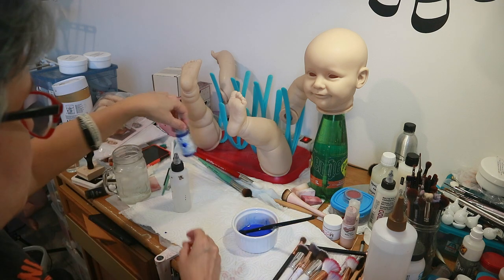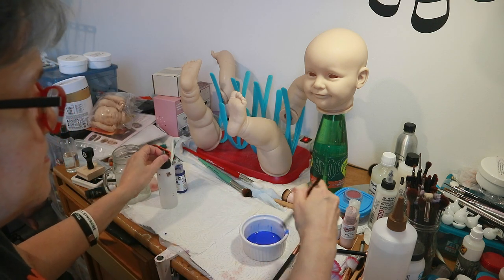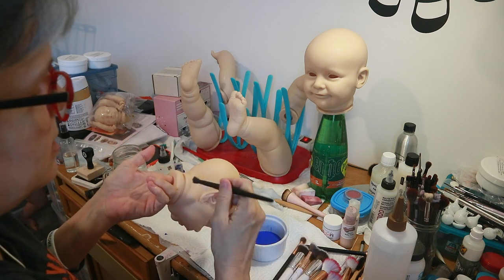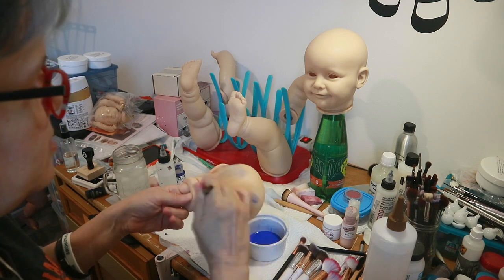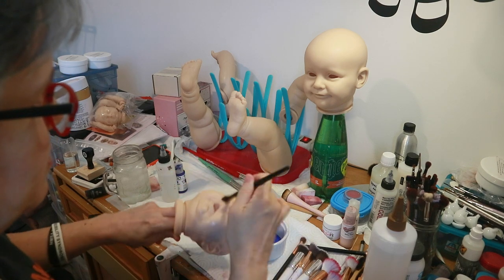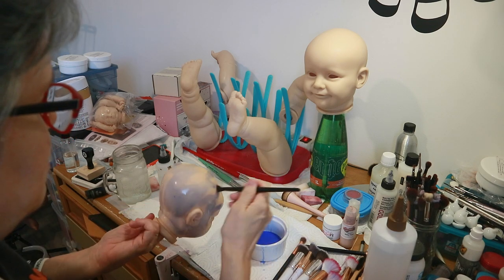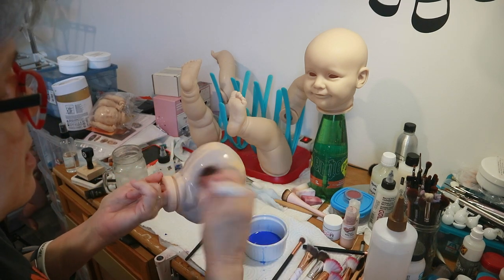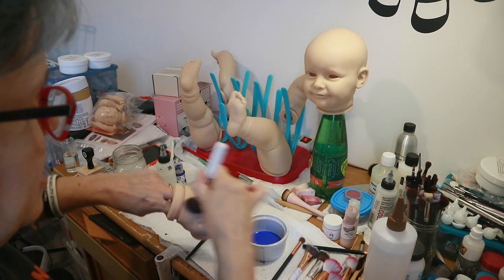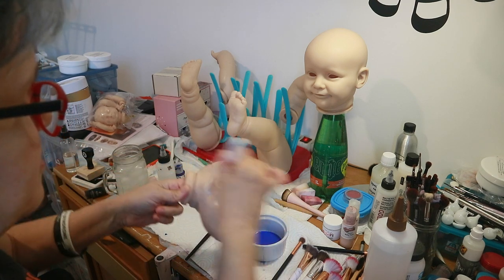All right, let's paint this baby. When I do washes I just paint it on and wipe it off — pounce it off, wipe it off. I make kind of streaks and then rub it in with one brush and rub it off with another, so just enough is left behind. I use one brush to make sure I get it everywhere. The wetting agent makes it more spreadable, and the satin glazing liquid helps too because it has more retarder in it.